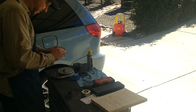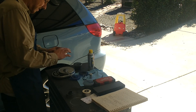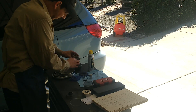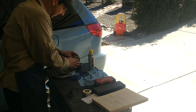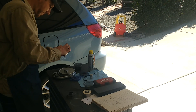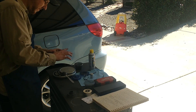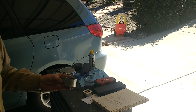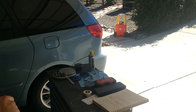I'm going to have to adjust my volumes a little bit. My first calculations didn't account for the density of the graphite and the bronze being so different. So this is going to be less than full density — I'm going to knock a little out. This is mainly to test if the die design works. So let's pull all the powder metal material together. I'm going to put the top on and press it.